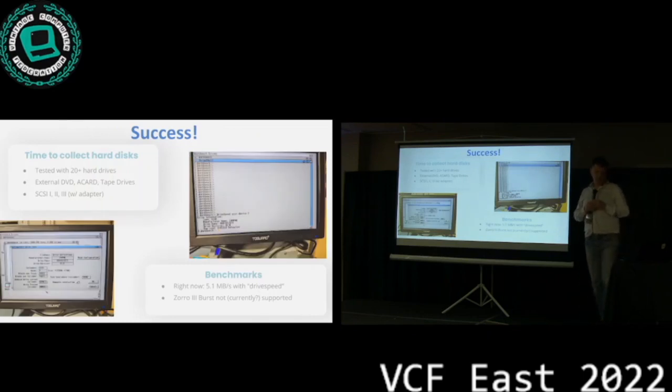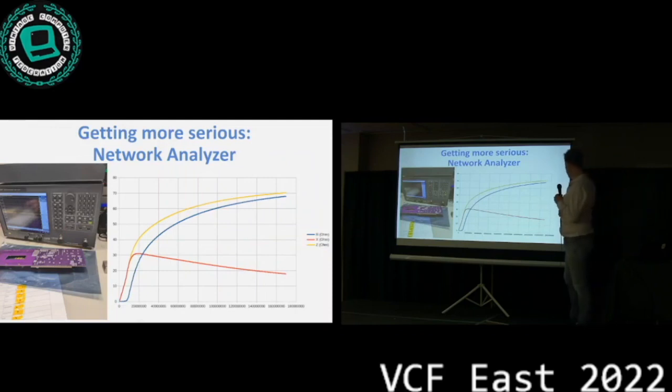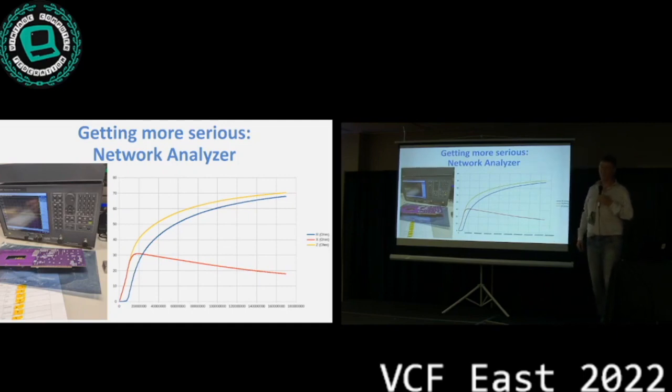So what came out of this, if you look at this curve? We put 600 ohm ferrite beads on there. Well, ours are in a range of like 60, 70 ohms here. And so that was one mistake. Basically, by the time you get to 25 megahertz, which is what the card is clocked with, these 600 ohm beads were just drowning out the signal and it was gone. Just enough to be a problem after a couple of iterations.